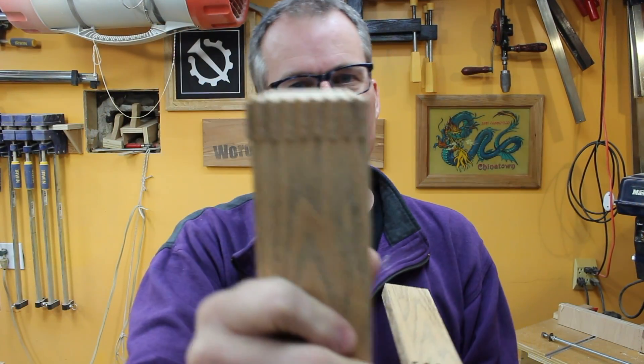So there you go — thick finger joints, thin finger joints. There's my quick tour of how I use the Woodgears box joint jig, all the math included. This is not a definitive manual because you can do all kinds of different things with gears and settings. In hindsight, having gone through all the math multiple times over these two videos, I think I probably should have been using the 12 tooth gear with the 48 instead of the 16 — it moves the carriage a quarter inch which is pretty much double the thickness of the blade. But it goes to show there's more than one way to get things to work out, and the joints turned out great. Thanks for stopping by and spending some time in my shop. If you feel I've earned it, please consider subscribing and we'll see you next time.